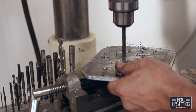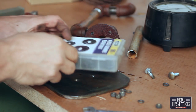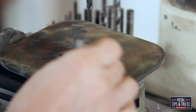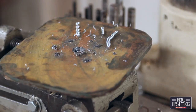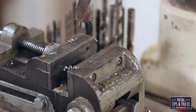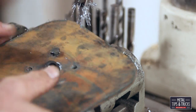Sizing up all the holes, making sure I get the bolts all the way in. Now, since I'm going to be running the wires right through the center, I just don't want them to rub up against steel. So I've got a rubber grommet. You can get a kit of grommets from Harbor Freight for about three or four bucks — well worth buying. I'm drilling halfway in, flipping the plate over, drilling a hole larger on both sides, trying to develop a shoulder. I had to go in with a countersink kit so now I've got a nice clean shoulder that I can fit that rubber grommet on.